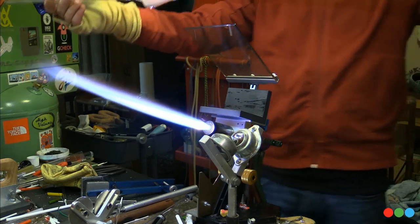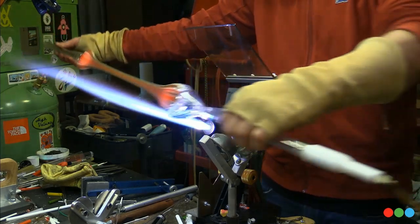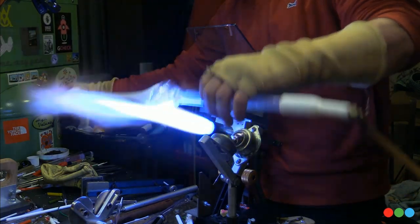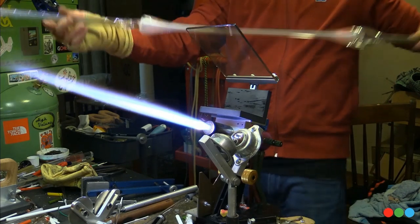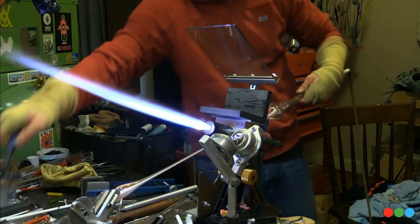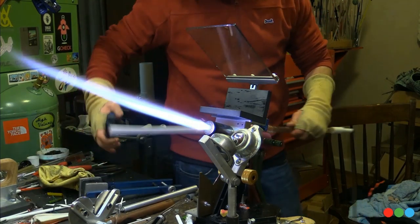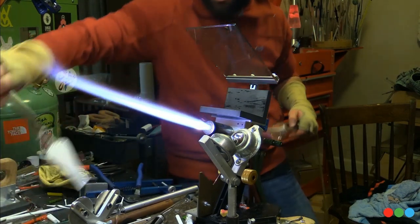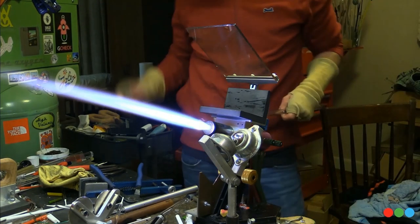And again, that diameter, it's all about that initial timing. Start the pull, but go very slowly, and then almost pause until it's where you want, and then you can continue the rest and give it an increasing amount of power until it pulls out the way you want. And definitely getting these nice even sections of the ribbon that you want is all a matter of even heat and timing during the pull. So yeah, I hope that makes sense.